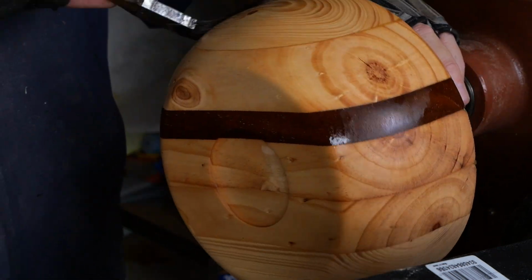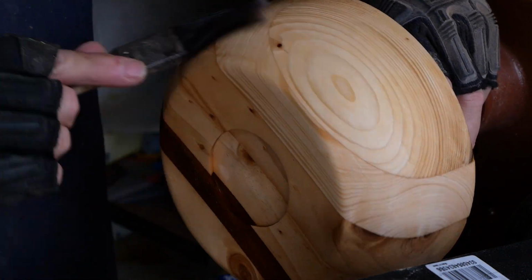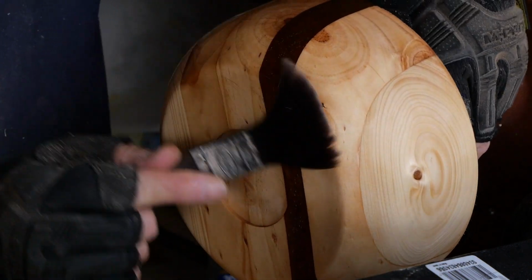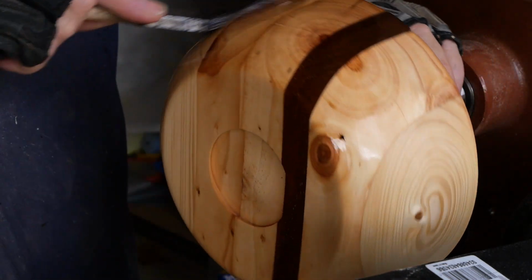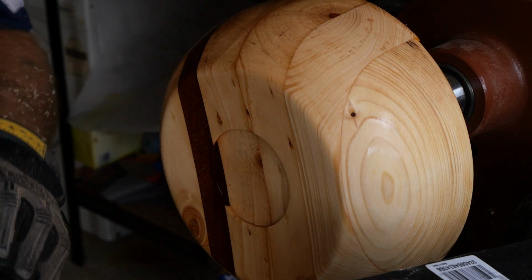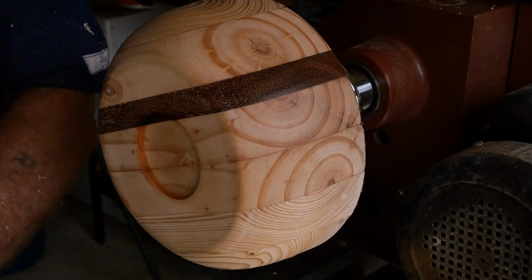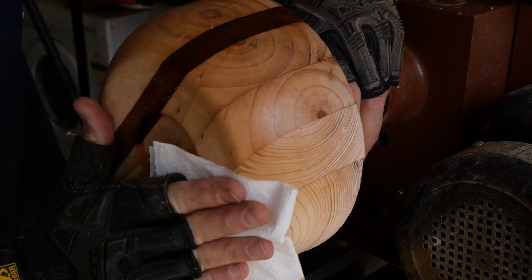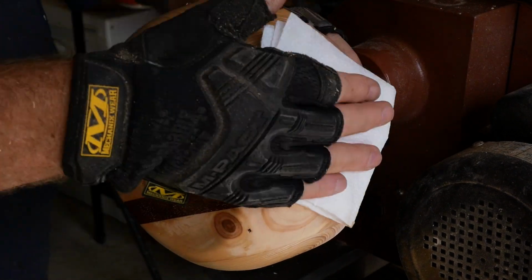So I'll let this dry, clean up the garage floor a bit, and come back and sand it 600, 800, and then I haven't decided what I'm going to finish it in yet. Probably Old Faithful Glow. We'll see what happens. So I'll see you soon. So I've sanded 600 and 800. Put some super glue on the inside of the mortise there, CA glue. Now I'm going to use some Yorkshire grit and Yorkshire grit fine. Hopefully this will bring it out a bit more, make it a bit more appealing.